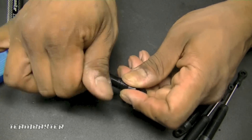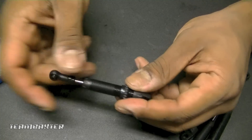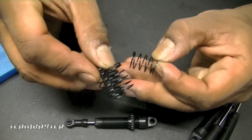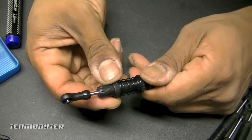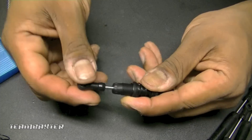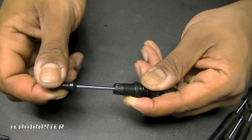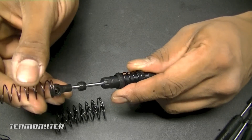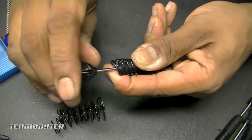Screw the adjuster on. It's a plastic adjuster, pretty loose — not the tightest adjuster there. Right after that, get a small spring which is knotted up in this bunch of four and slide that on. The little separator goes in there and it kind of hangs onto that spring. Get that on there. Get the piston pulled all the way back out. Pull the long spring out and get that on. While holding the spring on, slide the retainer clip.